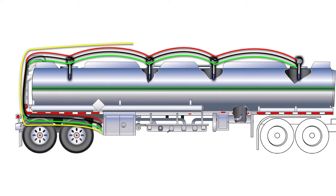When the yellow wire reaches the number one probe housing, it is connected with the yellow wire of number one sensor. The orange wire coming out of number one sensor then hooks to the yellow wire of number two sensor. The orange of number two goes to the yellow of number three, and this continues until you hit the last compartment of the unit. The last sensor in the trailer or tank, whatever the case may be, returns back down to the socket.